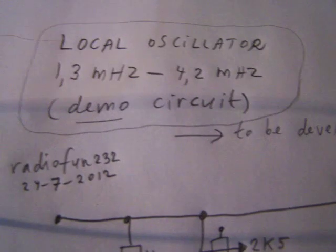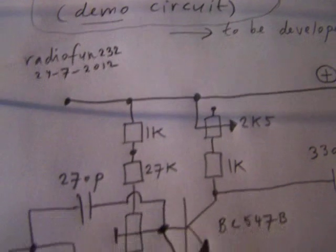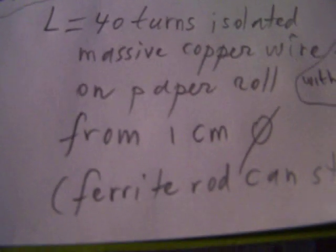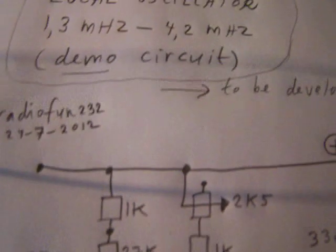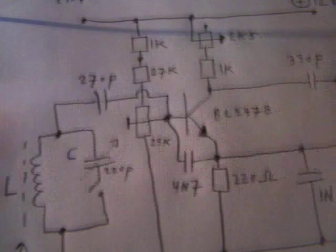And as you know, in a radio the local oscillator has to deliver a pure sine wave without distortion. That works best. When you have another waveform, let's say a square wave or a square wave-like waveform, it will give problems in a classic radio receiver.